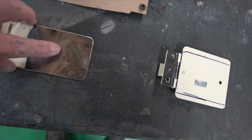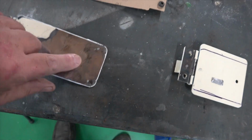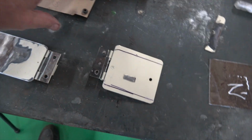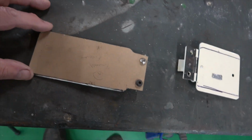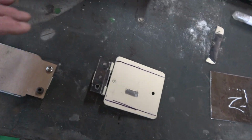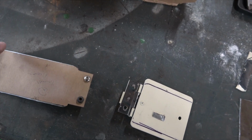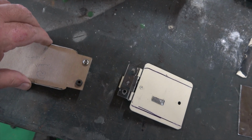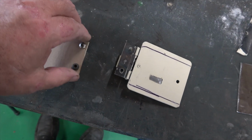A couple of bits there I might have to tidy up, but I can stick the weld in there. But generally it's pretty good. And it fits very well. They're the right size bolts for that, as you can see. That's a pretty good fit. But what I'll do is clean that up. And for David who's watching this, I'll leave a mil or half a mil or so on each side just in case this template isn't 100%, and you can shape it to fit, because I'm only going to put them in primer and I'll get on with the other one.